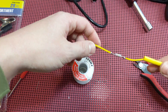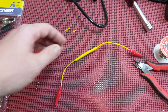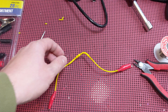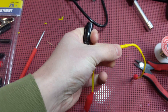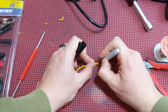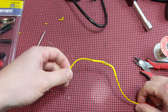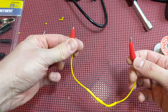Now we're ready for the heat gun. Put the heat shrink over like that and take the heat gun to it. Now that the heat shrink has cooled down, I'm going to grab a Sharpie and write on it so I don't forget how many ohms this is — I'll carefully write '220K' right on there. That way I'll know in the future. So now we have our homemade discharging kit. You should be proud. Now let's go discharge some capacitors.